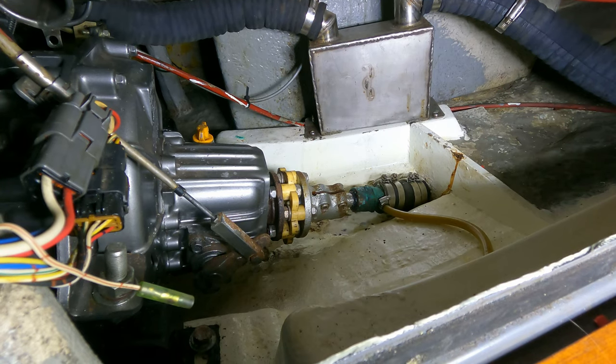Okay, so not ideal at all. It looks like it's dripping once every three seconds while it's running. Really not ideal. I guess the lesson here is: measure your packing thickness before repacking your stern gland. What an idiot I am. I did put the new packing up against the old packing and it appeared to be the same size, but I guess the old packing wasn't doing the job in the first place — so that wasn't the best idea I've ever had. I'm going to try and repack it in the water next time using a more traditional technique of pulling the packing out. One bonus to doing the work is I can now remove the stern gland nut with the boat in the water and pull the packing out and replace it without needing to pull the prop shaft out. So I guess that's one benefit — but hey, another failure. God love it.